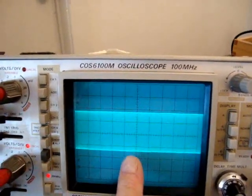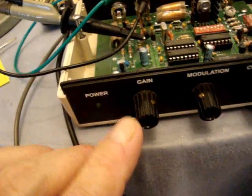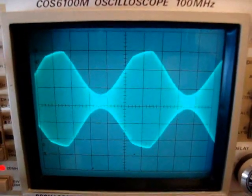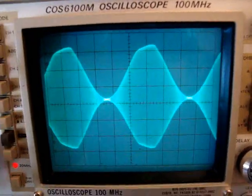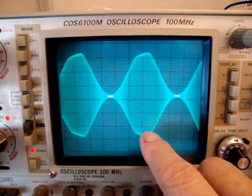We'll look at the RF envelope and the way it looks at the modulation. I'm going to turn up this gain with a 1000 Hz tone and we'll look at this envelope. That's 100% modulation — clipping the positive peaks on the top and bottom.